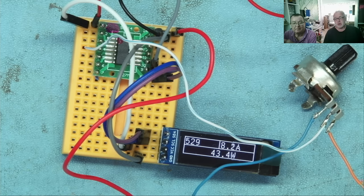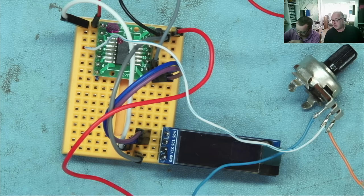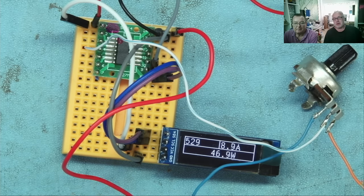And you see the little OLED display. This is a pre-made module. You simply drop in VCC and GND, and you can tell SCL, SDA. If you know your interfaces, you know this is I2C. And now the power bank has gone off. So that's the power. We're drawing so little current that the power bank always switches off.